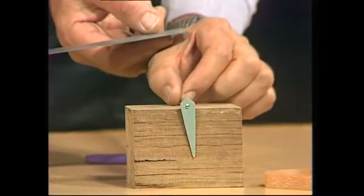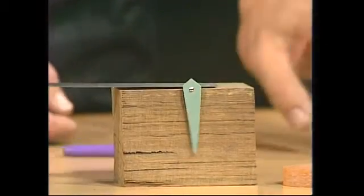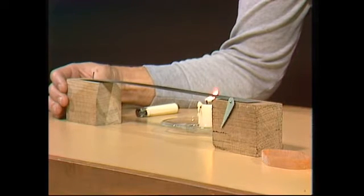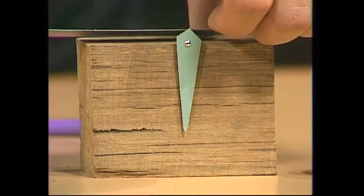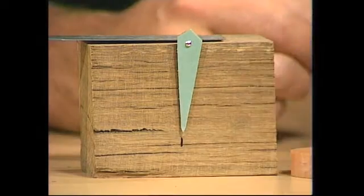If I put it on there, you can see how it's going to work. Rest it on that block of wood, let the pointer hang down, and put this piece of metal on top. And if we do something to make that metal grow in length, you can see it's going to roll over the top of the pin, and the pointer will go in that direction. Let's set it back to hanging down at the bottom, and we'll just make a little mark at the bottom of that pointer — that's before the iron has done anything.